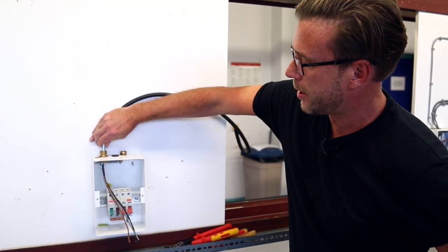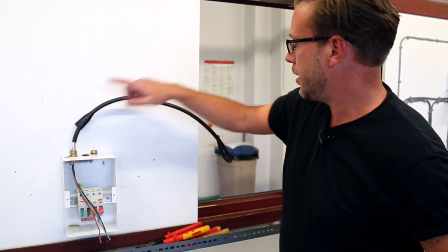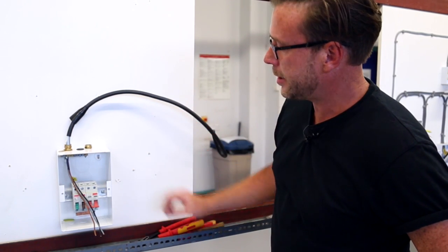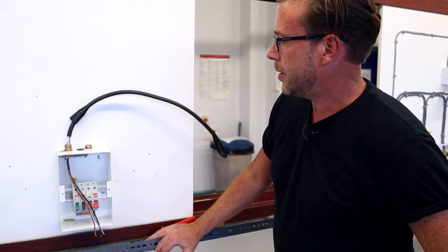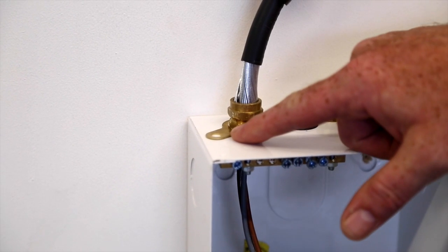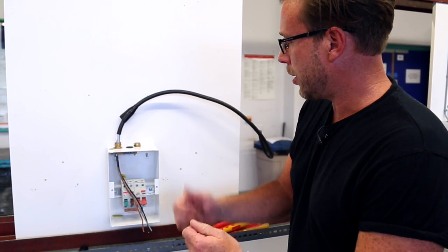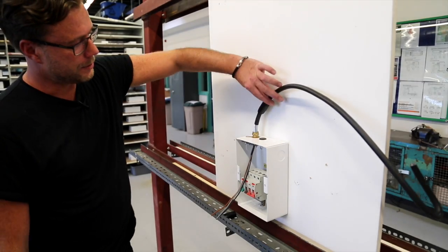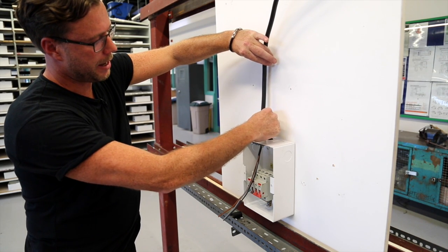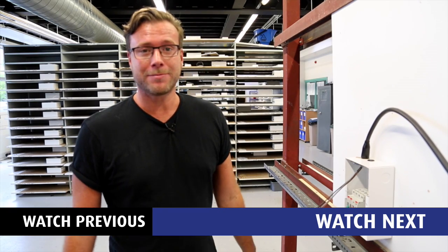We've got a good sound connection — the armoring to the gland — which is important, given that the armoring is protecting the inner conductors. Therefore there's an exposed conductive part that needs to be at the same potential as earth. And if that's not achieved through the metal enclosure, then that's why we have the banjo, where you're able to nut and bolt the banjo through the enclosure and put a lug on an earthing conductor and bond it down to earth. All that's left to do now is to slip the shroud over the gland, providing extra protection against the elements such as corrosion. And in our next video, we're going to be looking at some testing. Thank you very much.